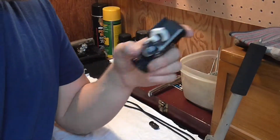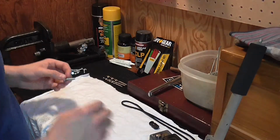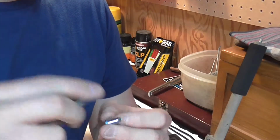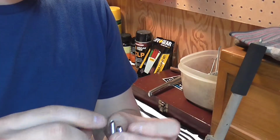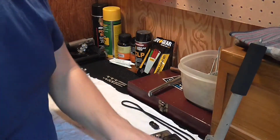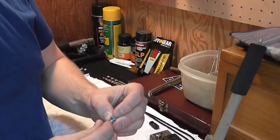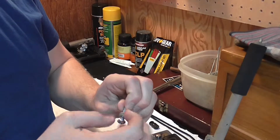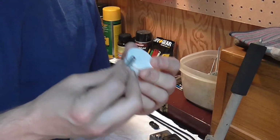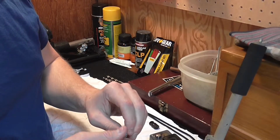being missing. With that being said, I will be drilling a hole through here, and depending on what I got, I have 3/4 and 1 inch, 1/4 by 20 bolts here. These are obviously just Phillips head. They will be going through here, and I was going to chop them down to fit perfectly, but what I'm going to do is just put a nut on here, and depending on how deep it needs to be, I'll just put another nut, and then I'm going to be epoxying the nut into the inside of this, so that everything is going to be permanent on this end.